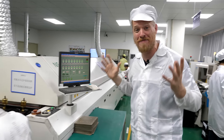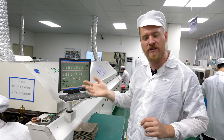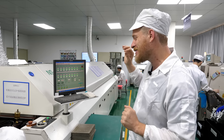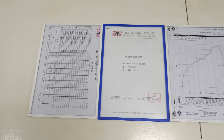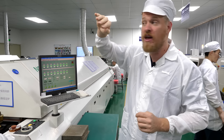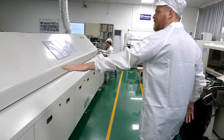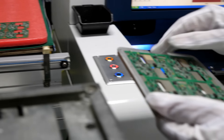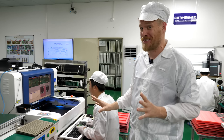Finally it's time to actually melt the solder. This is the reflow oven — think of a conveyor belt toaster oven, but much bigger and fancier. The whole board, solder, and components are raised gradually on a temperature curve to a maximum temperature where the solder melts, then gradually cooled on a specific curve. The boards come through on the conveyor belt very slowly, bringing them up to temperature and back down. Once it comes out the other end, it's completely soldered, and then it's inspected visually.